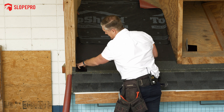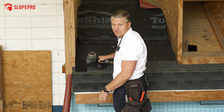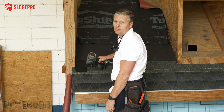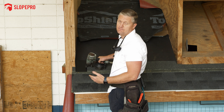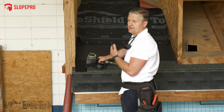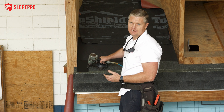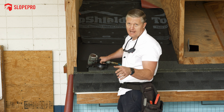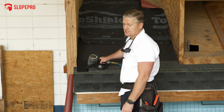One of the common mistakes I see in step flashing is guys will put a nail right here. The problem with that is water can run over to that nail. It takes 10 to 12 years for that to actually fail, but once it fails you can't just take out one piece of step flashing - you have to do the entire wall. It's a major repair for a misplaced nail. And anytime you're seeing misplaced nails, whether in the shingle or in the flashing, it's never just one nail - it's systematic. It's a guy who hasn't been trained properly; he thinks he's doing it right and does it the same way over and over, house by house.